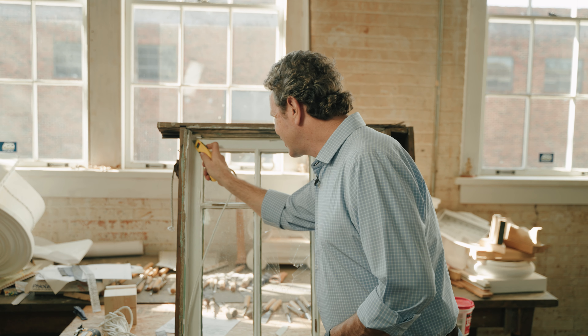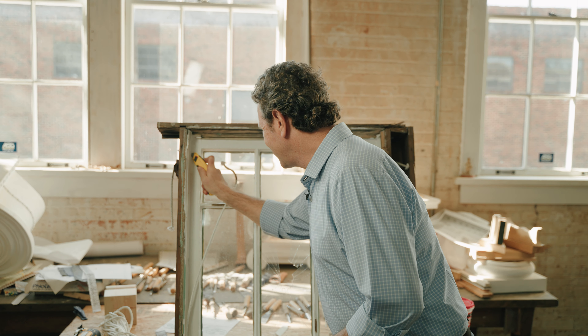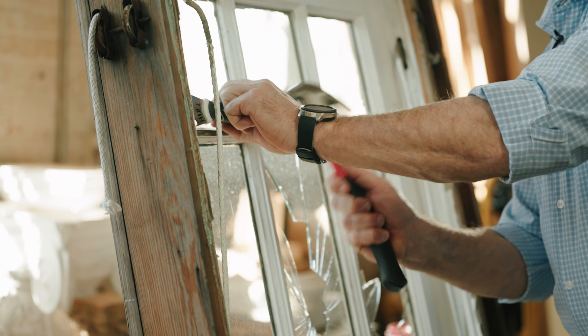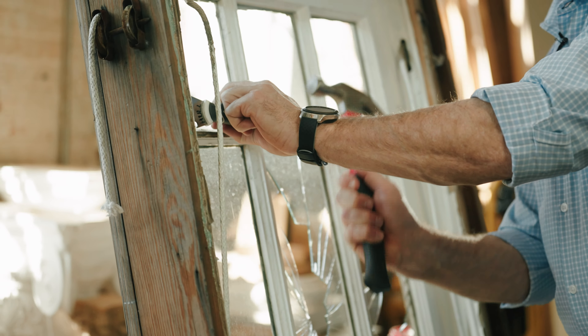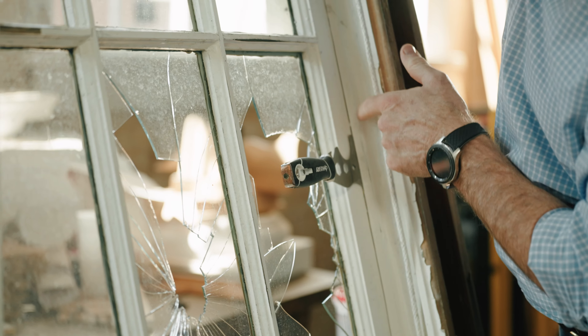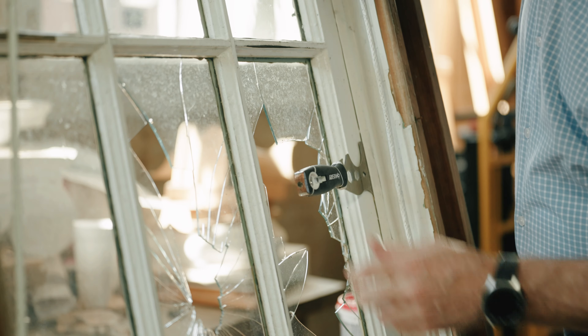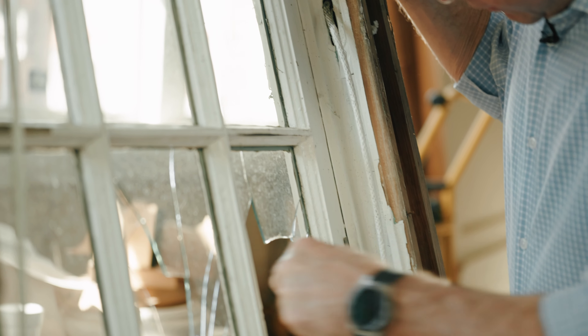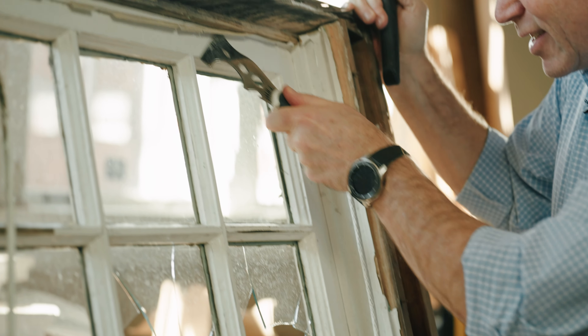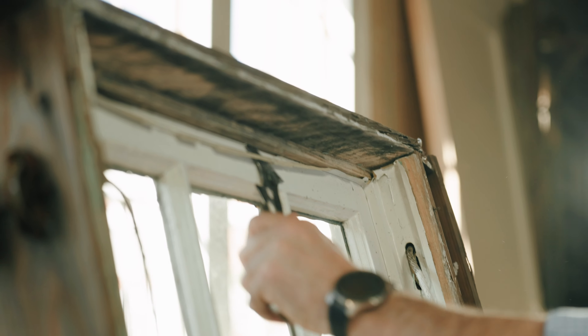I'm going to come in here and just cut that paint line. I can also do it with a utility knife — I stick the knife in there and draw it down. The other thing I can do is take a hammer and drive the five-way into that line. Watch what happens on this side — when I drive my hammer with the five-way in there, you can see how the paint line breaks up all down the window. Now I can move the window and I can see it's moving, so I know I've got it broken loose.